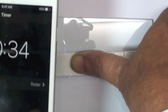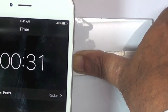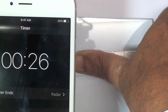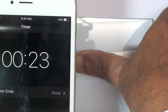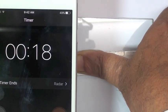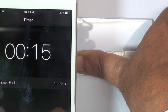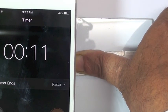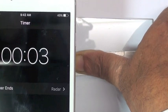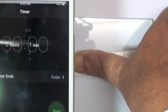It's important to remember that when we apply pressure with our thumb, we don't deform the component. So especially if you're doing this on a thin component, which can deform quite easily with thumb pressure, it's important that we have a solid backing, something to support it. Yeah, like the glass plate that we have underneath. Otherwise, we will have a deformed component on which we bond the gauge, and when we release our thumb pressure, it will spring back and we'll have a large tension in the strain gauge. Yeah, another way to produce an unwanted offset. So that's a good point.